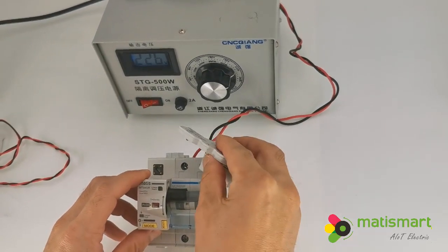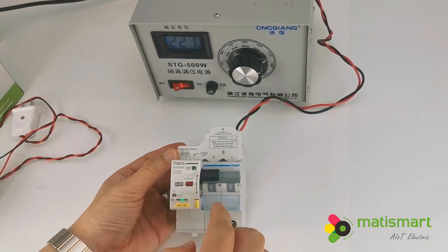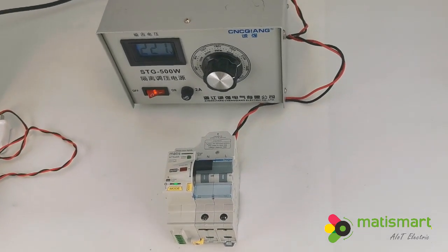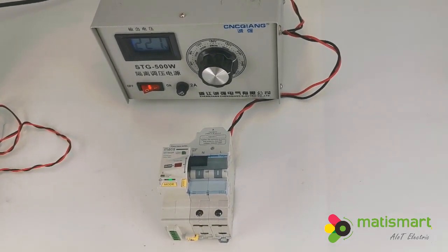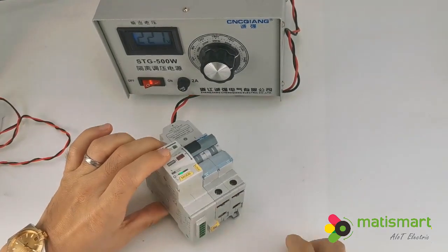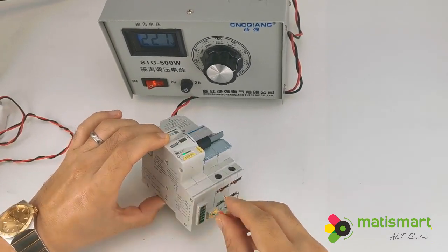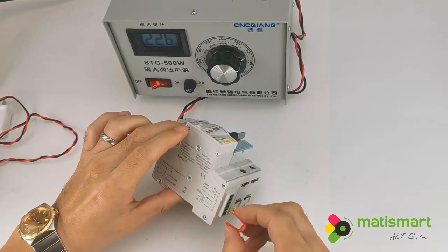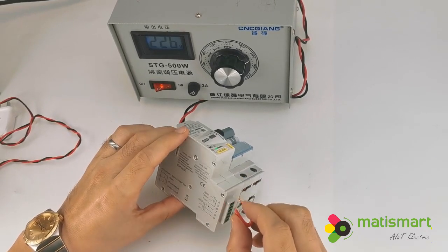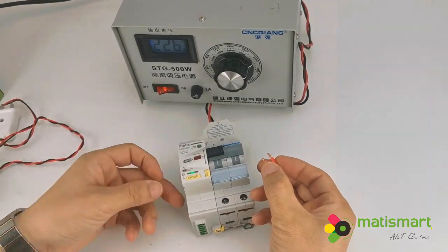It will also read the voltage between the neutral and the lines. Press in tightly. The device is now powered on. Let's first try the dry contacts. This dry contact is now in the on status. When we connect terminals 4 and 6, it will trip — this is remote control through dry contacts. For close, terminals 5 and 6 are connected. Let's try again: 4 and 6 to open, 5 and 6 to close. This is the dry contact input for remote control.